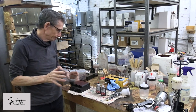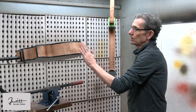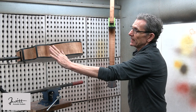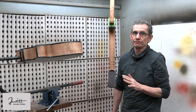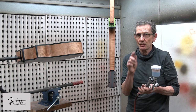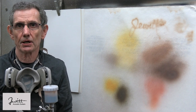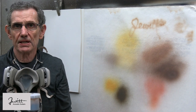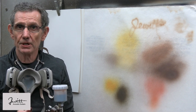To prepare, I sprayed a light coat of thin lacquer over the entire body and neck. That lets you see what you're doing and shows your progress as you blend the dark area into the lighter areas. I also adjusted the gun down to a very fine spray pattern. The fan for the spray booth is running at a low speed so you can hear me talk — normally I'd have it at a higher speed and be wearing my mask. When you do this, please wear a mask.